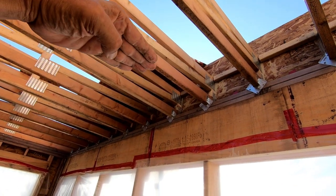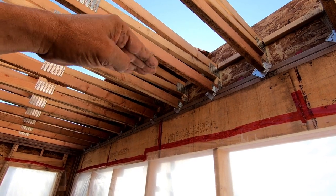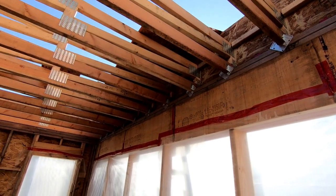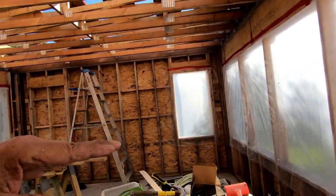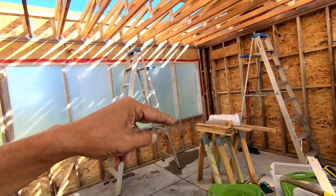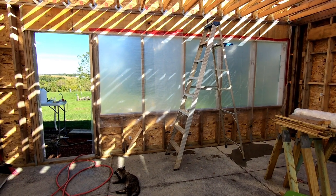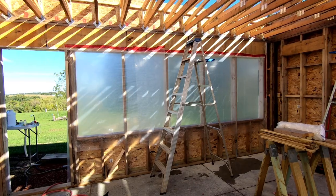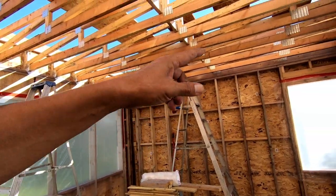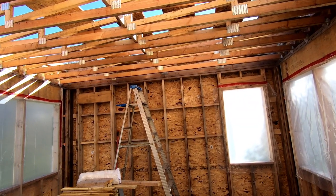Then you push the scupper through the hole, nail it down with copper nails because it's copper, and then you put your glue on around the edges. You glue rubber, I forget what it's called, but it's made for like drip edges and stuff. It'll go over metal.